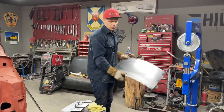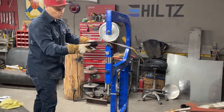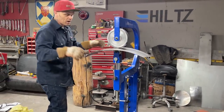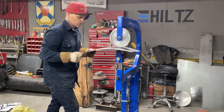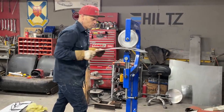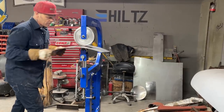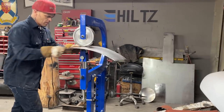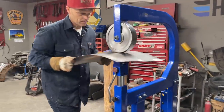The 80 grit will take you to your metal. So basically, what I'm saying is I do not want to go too far. I just want to go far enough I get some shape, and then I can run it out with a nicer die. If I had hit this with the hammer and the bag, I'd have made too much shape, too quick, too fast, and been cutting another piece.